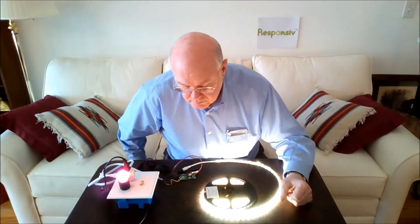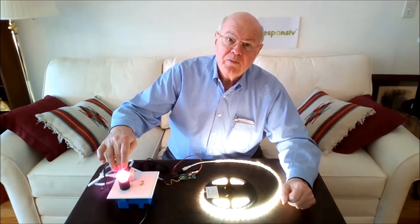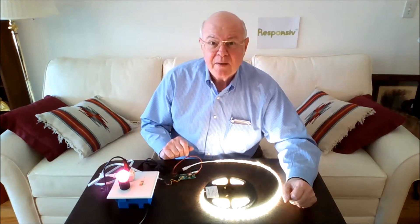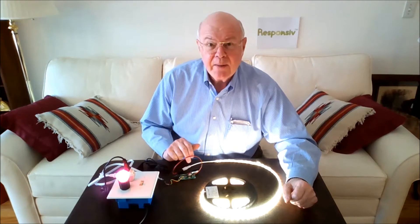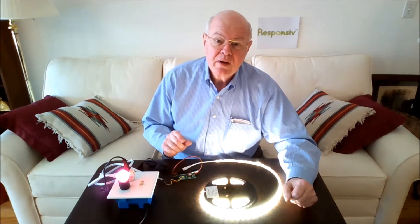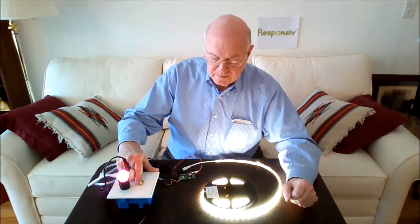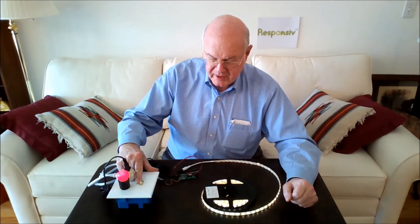If you look closely, you'll see that the profile is not quite exactly the same, and that is by design. When the incandescent bulb comes on at its brightest position, it's not as bright as it would have been if the dimmer weren't there at all. The reason is that even with the slider all the way up, the triac dimmer cuts a small portion out of the AC waveform, which makes the bulb come on dimmer. Our adapter knows about this phenomenon, so it won't start to dim until it notices a wider interruption of the AC power waveform. As I pull the slider down, you'll see that the LEDs dim a little bit faster than the incandescent bulb, and this again is by design.